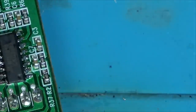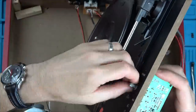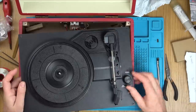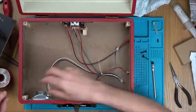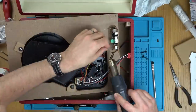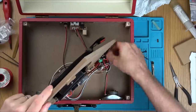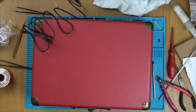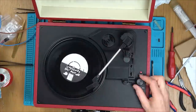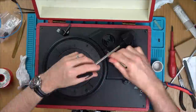Let's wash this down and put it back together. Maybe this chip has also taken out other stuff, maybe some other stuff took this chip out — I don't know if this is going to work. I've got my meter set to continuity — it's not shorting with that one there even though it looks like it is. I think that's all good. Let's get this back in and see if the record player is now playing. It's nice and straightforward to get the board back in — just need to add a little bit of hot glue where the headphone jack was, the LED, and also the volume control.